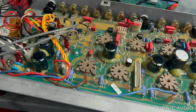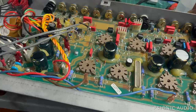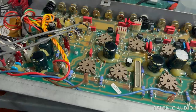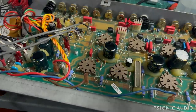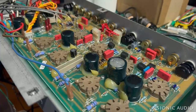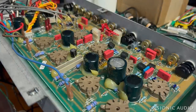I've got it all plugged in and ready to power on. I see little glowy lights in the EL84s. Let's take it out of standby — and a pretty good hum there. Very dirty pots. Let me power this off and make sure all the screws holding the board in place are tight, because some of these screws are ground connections that make the ground for the circuit to the chassis. They weren't all as tight as they could be. Let me grab the guitar while it warms back up and see, behind all the noise and crackle from probably dirty pots and maybe a couple of bad solder joints, what the core sound is.